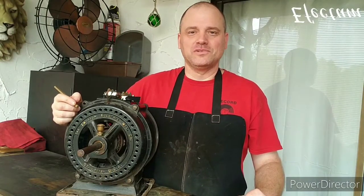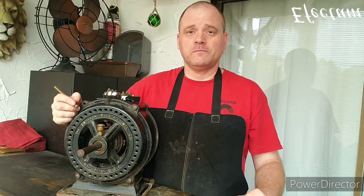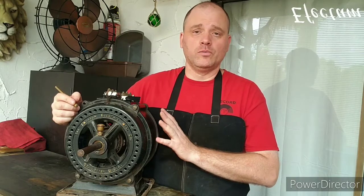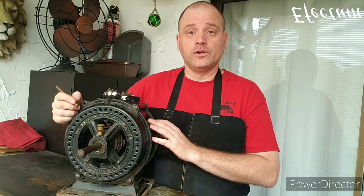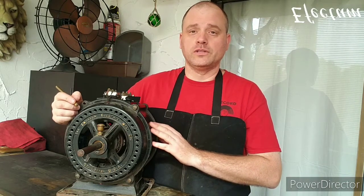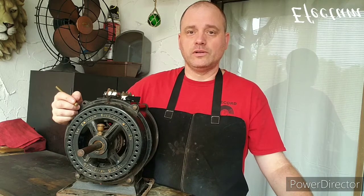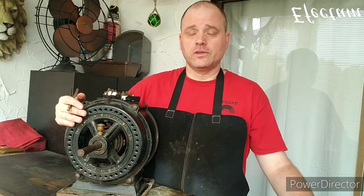In this video, we're going to be restoring a rare electric motor made by the Emerson Electric Company. This motor dates to about the early 1900s. One way that you could date it is that the motor is rated to run on 104 volts as opposed to 110. The switchover to 110 occurred somewhere around the year 1910, so we know that this motor is definitely older than that.